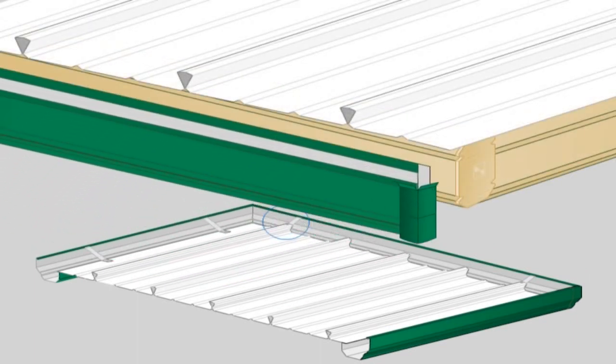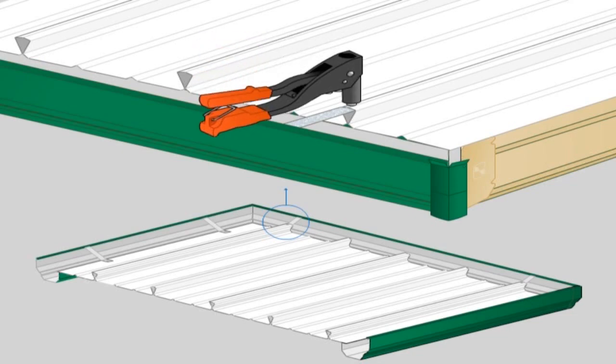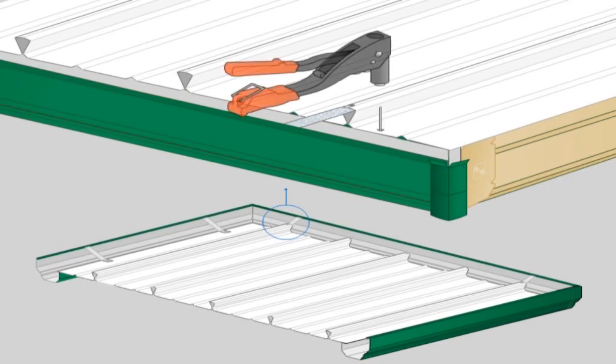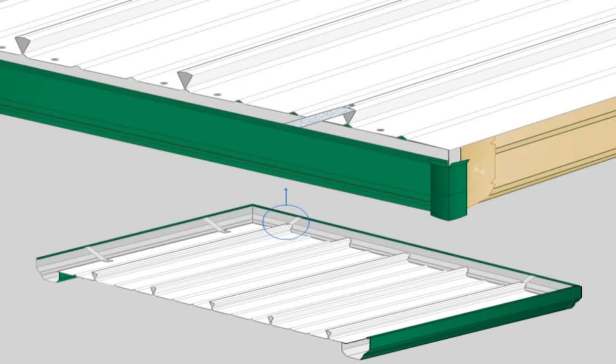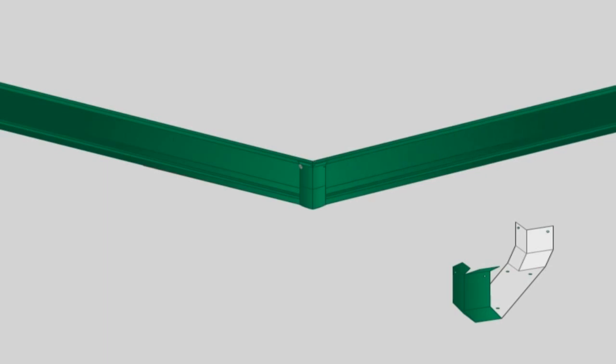Front gutter assembly. Attach a mitre to the front gutter at the opposite end of the side gutter. Slide the flat end of the gutter straps inside the ribs of the roof sheets every metre. Hang the front gutter on the straps and using a rolling action, lift the back of the gutter into the corner mitre of the side gutter. Check that the roof sheets overhang into the gutters by 50mm and that the gutters are square in relation to the framework. Fasten the front gutter with rivets at 1m spacings through the ends of the roof sheets into the gutter's back lip. For units with a deck overhang, fasten the gutter to the roof sheets using 2 rivets per pan. Rivet and seal the front gutter to the mitre and the gutter straps to the roof sheets. Cut a 45-degree mitre on the ends of the gutters and fit the mitre using 3mm pop rivets, then waterproof with silicone.